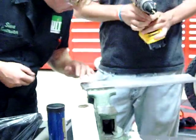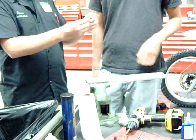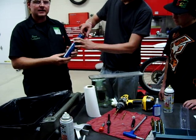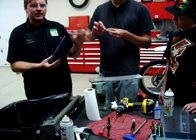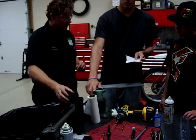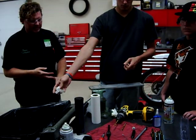We're going to check our work — he's got a nice little lead-in here. The next step is we're going to tap this to the appropriate size using the tap that came with the kit. To do that, he's going to put some lube on there. One thing you never want to do is dip the tap into your grease, because you use that grease on engine parts, wheels, bearings, and other places — you take a chance of putting those contaminants in here. So he's going to lube that up good. That's going to allow the chips to catch in the tap to keep it clean while he's threading it.